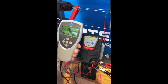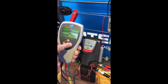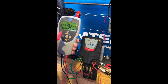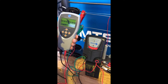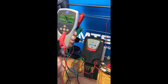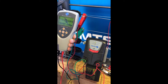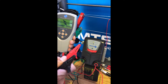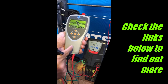The second mode is energy mode. This mode is quite unique in that you can actually simulate an animal on your fence. With probe mode you can see the voltage on a one kilometer fence, but with energy mode you can simulate an animal touching the fence. There's a 1000 ohm load inside the unit for this purpose.